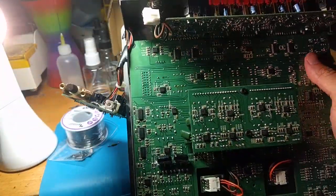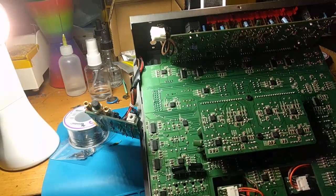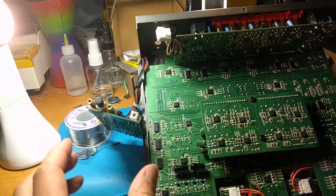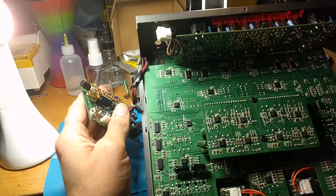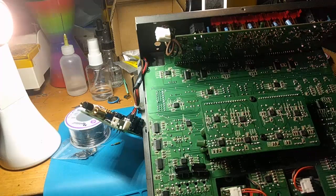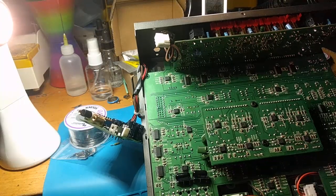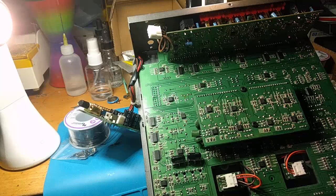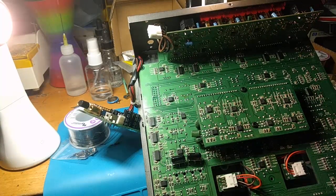And for audio stuff, people don't like to use switching power supplies very often. Also, when you're doing this much with preamps, it makes more sense to have multiple voltages. Most preamps are going to be dual voltage, and if you have different kinds of preamps wanting different kinds of dual voltages, you already have 4 different voltages right there. All you need is 2 preamps with different voltages. So that's why they did it, I'm quite sure.